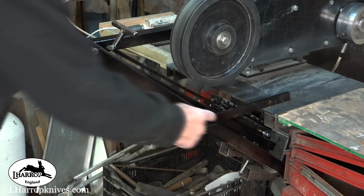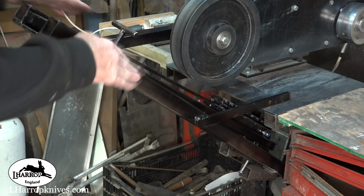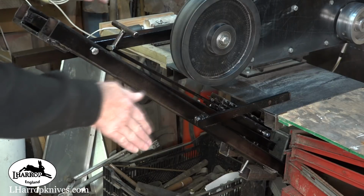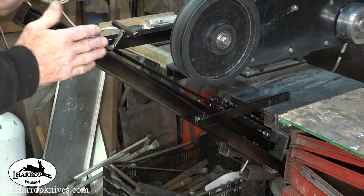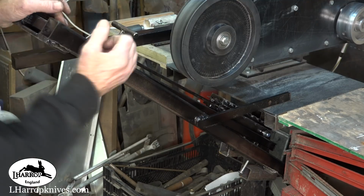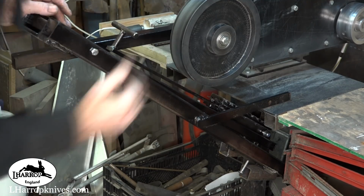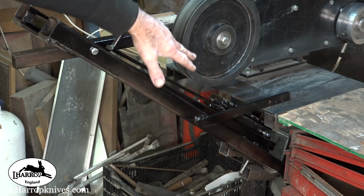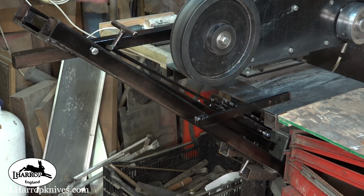And what I've also done on this side, I didn't want the chassis sort of flexing. I mounted it on and looked at it, and there wasn't really a lot of flex in it. Gave it a good pull and there was maybe 1 mil of movement, and I thought on the actual chuck there's not going to be much weight on the chuck.